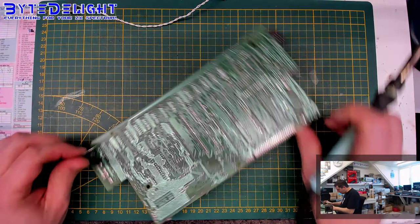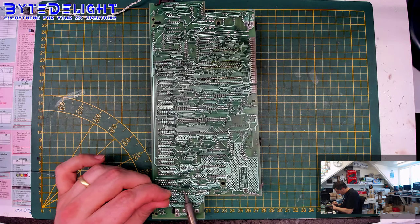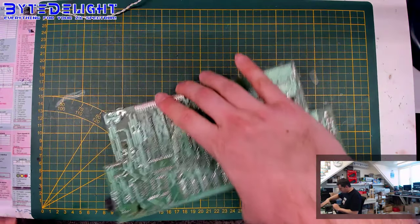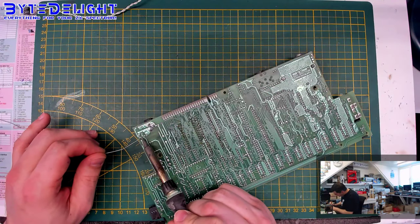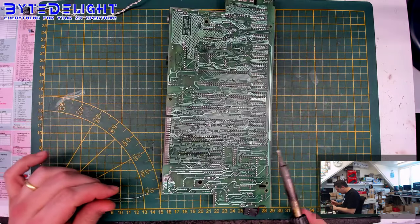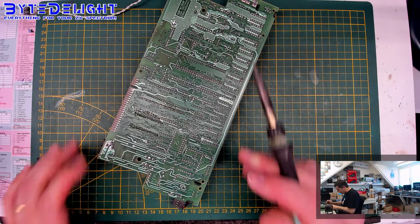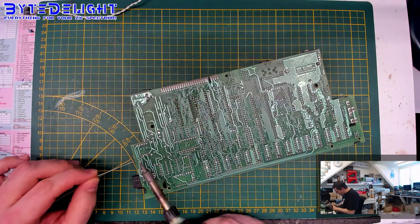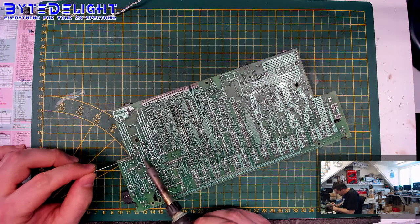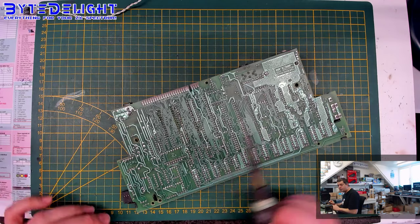All right. I always add some solder on the pins that I'm going to desolder in a moment. And I will use my desoldering station for that. So let's power it on. Sorry for the bump. So let's go on, because the pins are always bent on the bottom of the board, which makes it hard to do these by hand. You have to straighten the pins first if you want to do that. So I prefer using the desolder station for that, but the problem with the desolder station is that the tip doesn't get hot enough from time to time to actually melt the solder on all these pins and get the holes emptied, the pads. So I will give it a try with the desoldering station, but first let's do this.